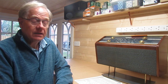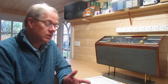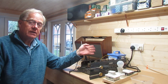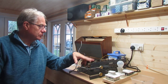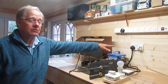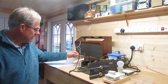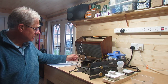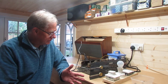I'm going to start taking this radio apart and lay it out on the bench. I've got things set up with an isolation transformer — which you don't strictly need for this type of radio, but since I've got it I like to use it. It means I can earth the chassis. That way if I've got a scope and something goes wrong, the current goes through the earth wire and not through the scope. I've also made a slight extension lead for the speaker using a couple of crocodile clips so I can run it. Most importantly I've got a lamp limiter in here.